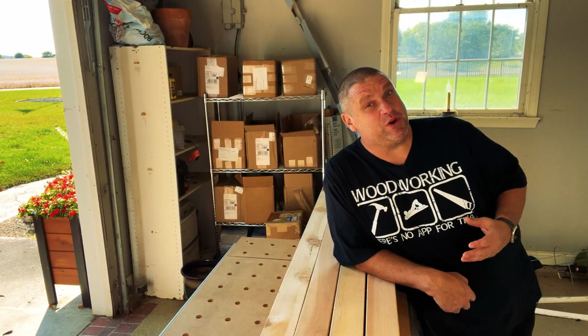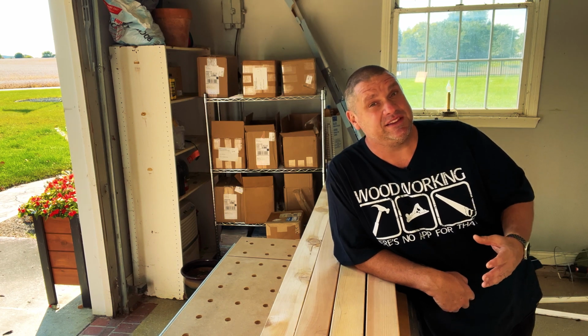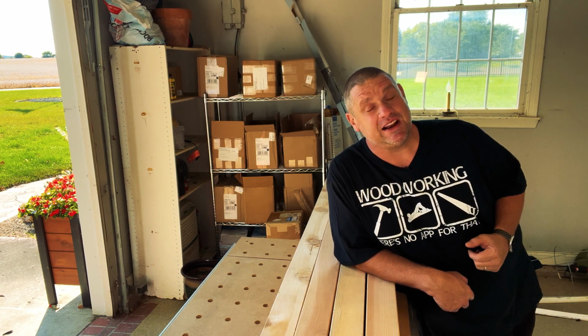And it appears from the photograph that this table has a square top and a square bottom made out of 4 4x4s. And since we're dealing with 3 3/8 inch stock, we can do some math and multiply that 3 3/8 of an inch by 4 to give us 13.5 inches.